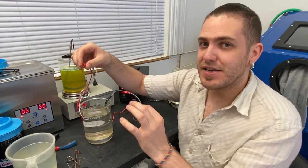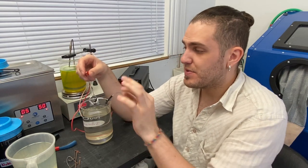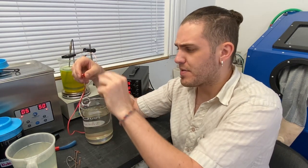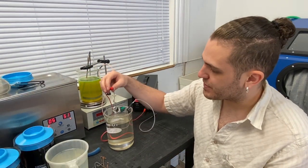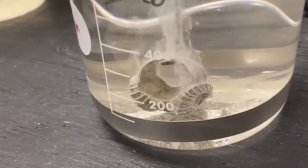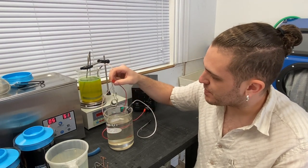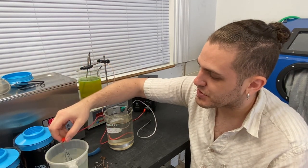I have a dedicated copper wire for silver plating — that wire itself is also going to get plated with silver. You don't want to waste the metal in solution on the holding wire; you want it to go onto just your work. We drop the piece into the side and let it do its job. The longer you leave it in the plating solution, the thicker that metal coating is going to be. This piece has been sitting in the solution for about three minutes, depositing a very thin layer of silver.